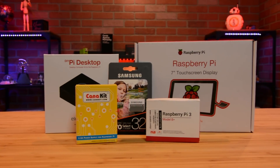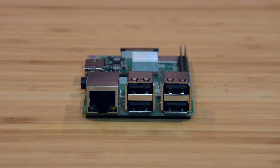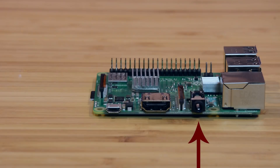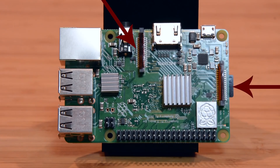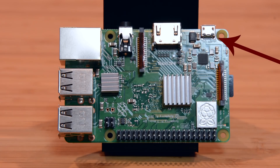Let's start with the basics. The new Raspberry Pi 3 B+ comes with a quad-core 64-bit processor at 1.4GHz. That's a 10% increase from the older Model B, which already had a solid 1.2GHz quad-core processor. The new B+ model also has 1GB of RAM, 4 USB 2.0 ports, a stereo output jack, a full-sized HDMI port, CSI and DSI ports for cameras and displays, a 40-pin GPIO header block, and a beefy 2.5-amp power source limit.